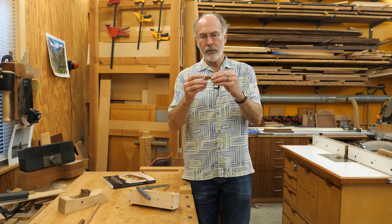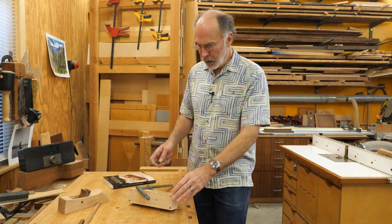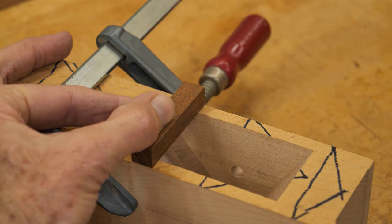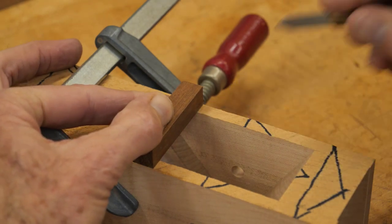The other way I like to do — but you need a lathe and some rudimentary lathe skills — is to chuck this in a four-jaw chuck after you've created the shoulders, and then carefully turn the tenons on each side to fit in those holes. That pretty much guarantees your tenons are going to be straight and in the middle of the half-inch square piece. I'm going to mark where my shoulders need to be, then go to the table saw and make four very shallow cuts on either end to get started.